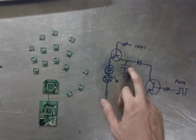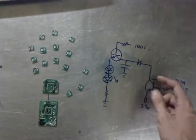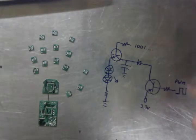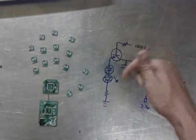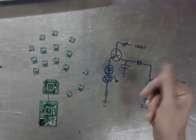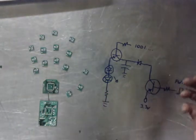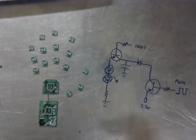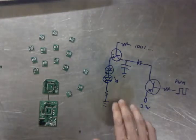I forget. And it has a big tank capacitor, which is actually a series of capacitors, but you get the idea. So there's a pulse width modulation signal that gets driven from the CPLD. Given the data coming in, which the CPLD also knows about, we can tell how many times those LEDs have come on, and since we know everything there is to know about this capacitor, we know how much charge is going to run through those LEDs on every single pulse that goes through it. So in this way, I hope to be able to control the emissivity strength of the LEDs.